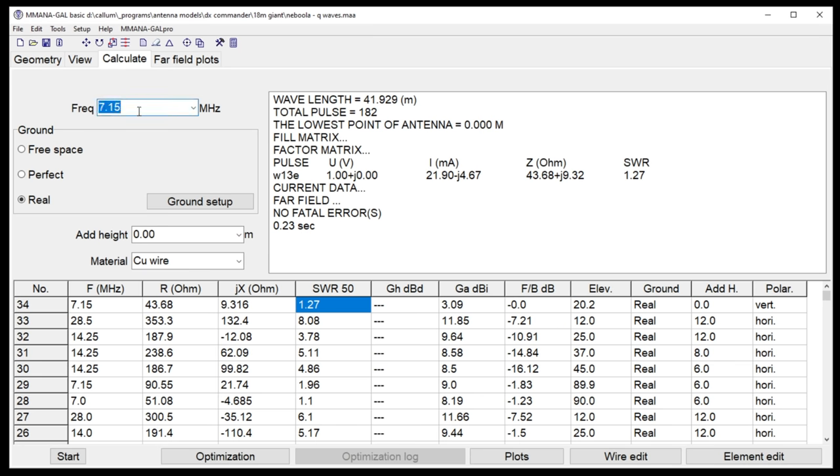A vertical picks up all around — including your neighbor's fridge noise. One way around that: most decent radios have a receive jack on the back. Run a bit of coax out to the backyard with a loop on the ground — costs about 10 dollars. Search 'loop on the ground' with a binocular core. That gives you a fantastic receive antenna combined with this tremendous transmit antenna.